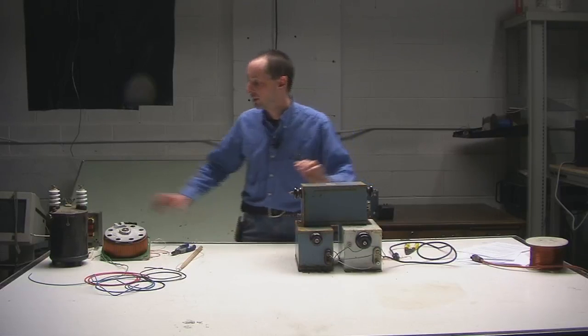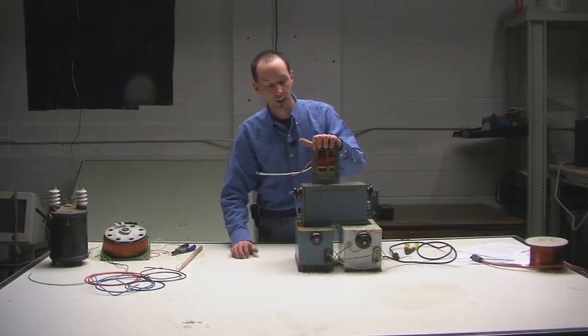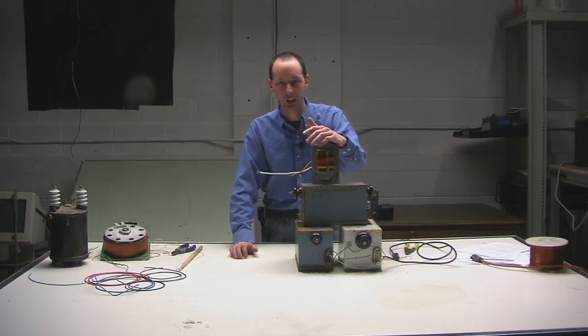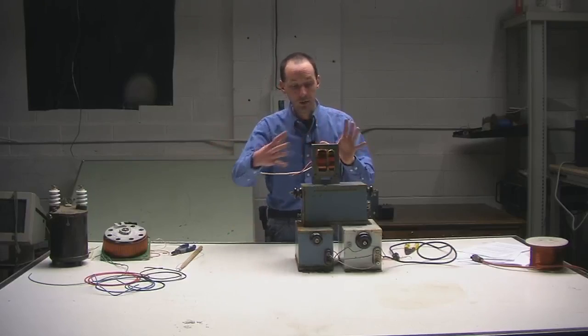Just, even stuff that looks relatively safe, like these. This is a MOT, a microwave oven transformer, MOT. These are nasty little bastards. Okay, they're not current limited. They are kind of, yeah, I know they got shunts in them, but effectively, they're not current limited. And the fact that the voltage is low kind of tricks people into thinking they're safer than they really are, because they don't have big high voltage bushings on them.